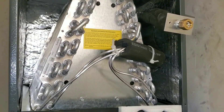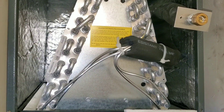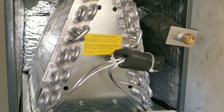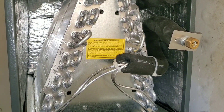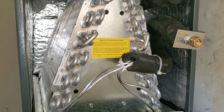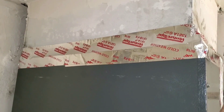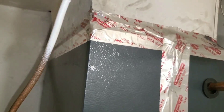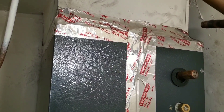Be very gentle when you're sliding in your new coil — you don't want to cause any unnecessary damage. Now we're going to put our front panels on and make sure that our frame is nice and tight. Even though I put duct seal on the inside of the duct and the frame, I do like to go over with some taping both on the top and the bottom.